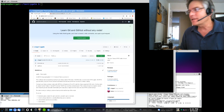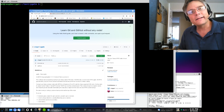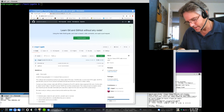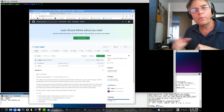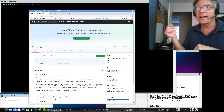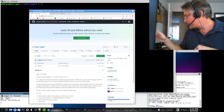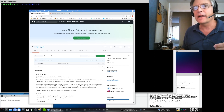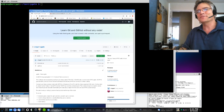So let's see if we can put something like this together. I have an FTM 400 here — this also works on the 100. In your box you'll notice this cool cable; it's a USB to serial cable. This will take the APRS packet data from your radio and transfer it into a Raspberry Pi or PC. And then I've got this script called Y-Gate — the Y is for Yaesu — which converts the packets from your Yaesu radio through the serial cable into APRS packets and sends them onto the internet to the APRS information service.